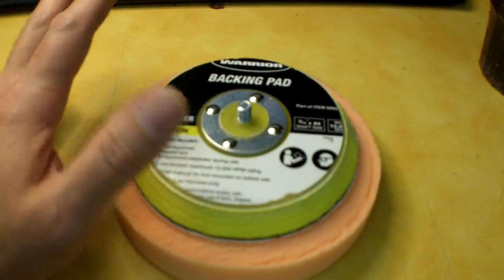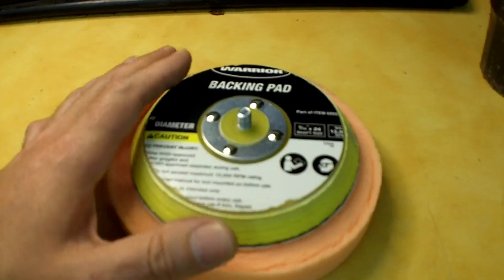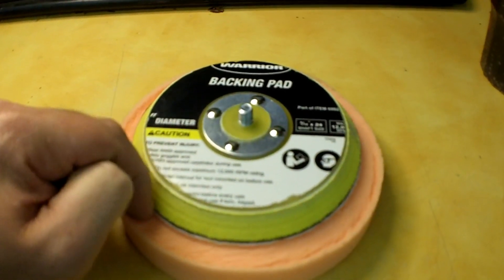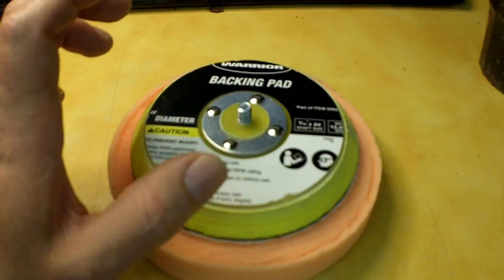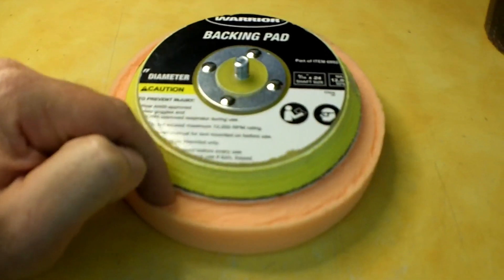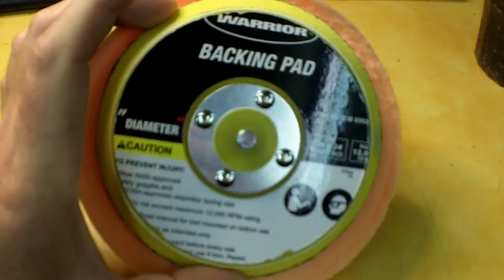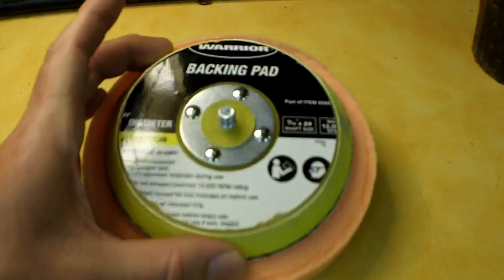What I will say is that it seems to have disturbed the balance a little bit, because the counterweight on the machine — I'm making the assumption — is for a 6 inch diameter. Before I took it apart to shave material off, without a pad on it I just turned it on and it was actually really well balanced in my hand. It seemed to get a little unbalanced when I put a pad on it — a little bit of extra weight would start shaking a little bit. So I'm going to use it as intended at this stage with a 5 inch pad and the same counterweight in the machine, which I believe is for a 6 inch.